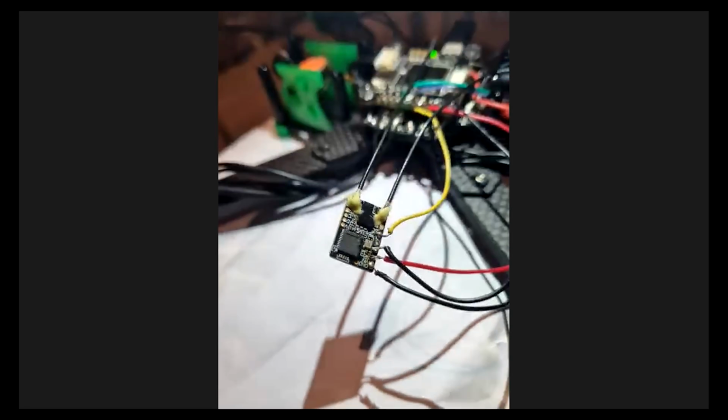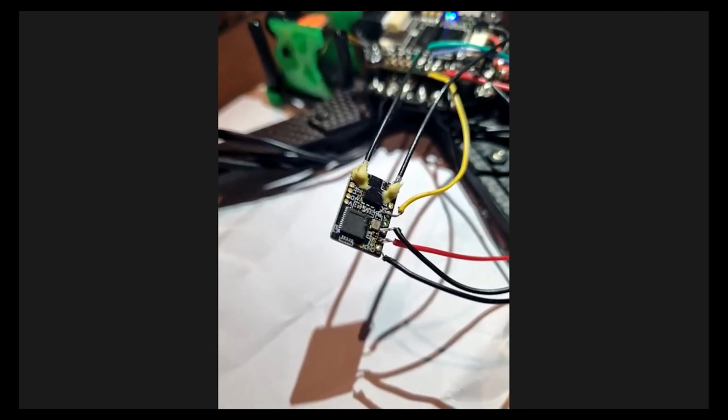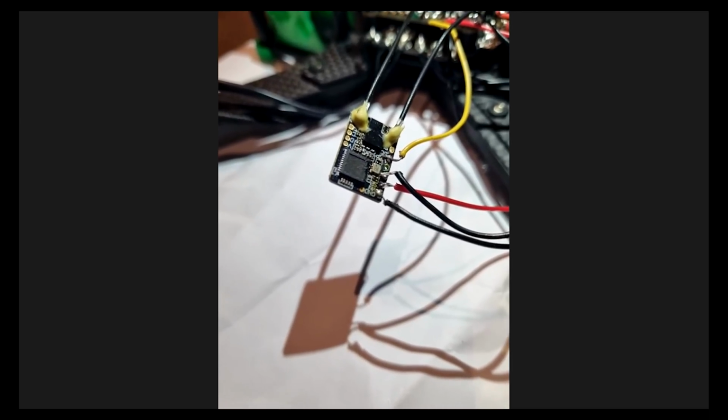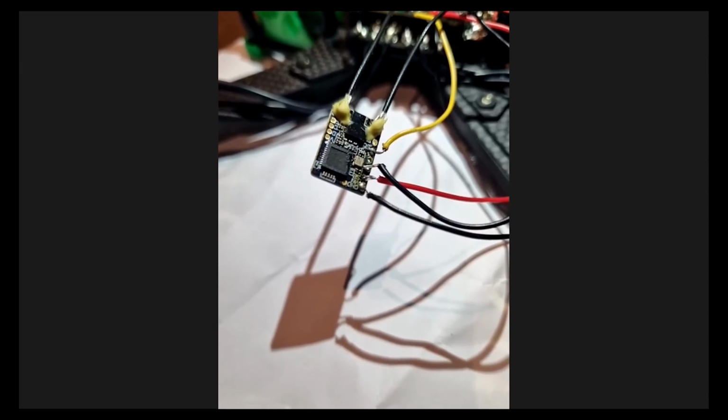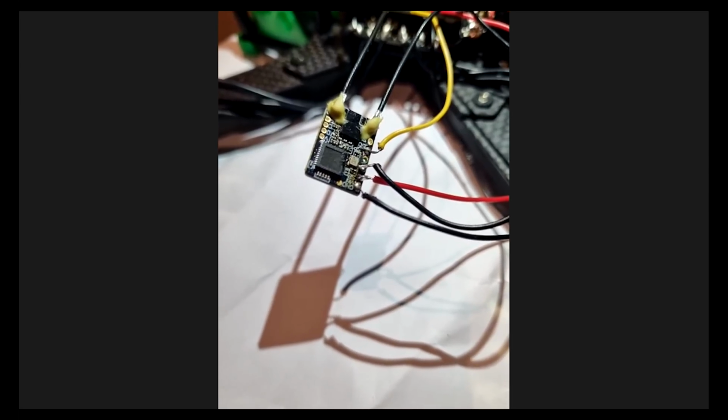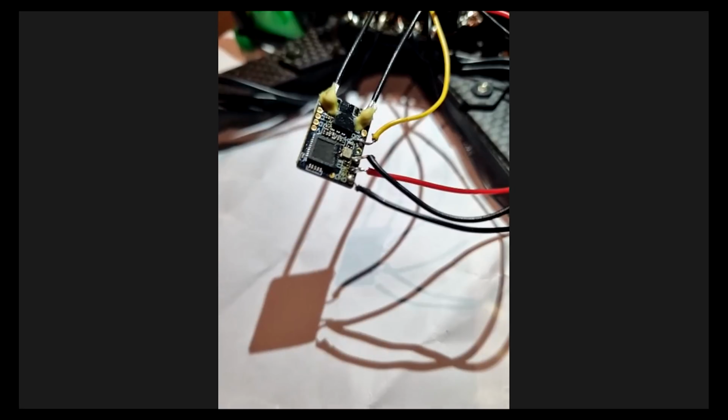The plastic insulation on these wires is very difficult to solder well because the heat of the soldering iron melts back the insulation as you're trying to solder it. Wires with silicone insulation are easier because it doesn't melt like that. It might be preferable to use the through holes, put the wire through the through hole and solder it that way. Yeah, so that's fine for now, though. We'll let that pass for now.